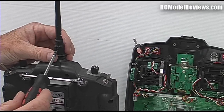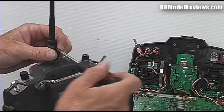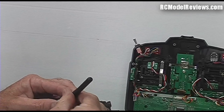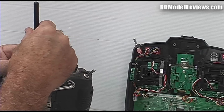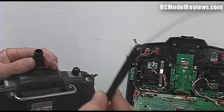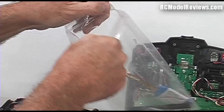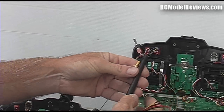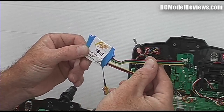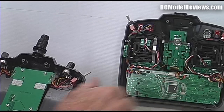To remove the built-in antenna, there's a little Phillips head screw in the top at the back. Remove that screw and the antenna should come out - and indeed it has. That is the old antenna we will not be using. Our FrSky DIY kit has a basic circuit board inside heat-shrink wrapping with a bunch of wires coming out one side and a single antenna wire coming out the other side. Now that we have the old antenna out, we also need to remove the antenna holder piece at the top - there's a tiny Phillips head screw in there.